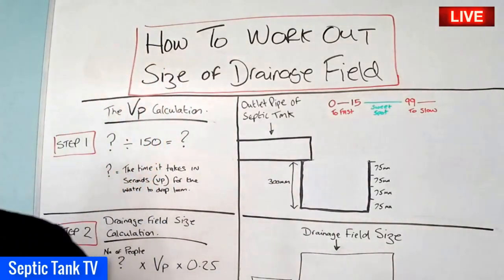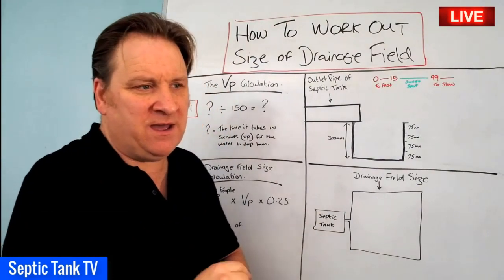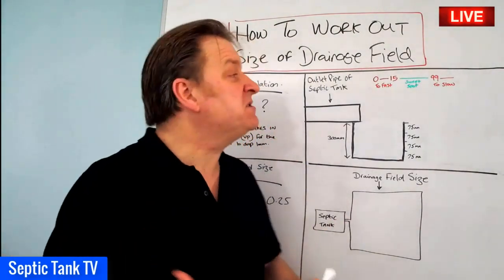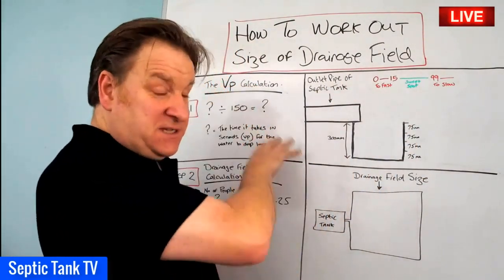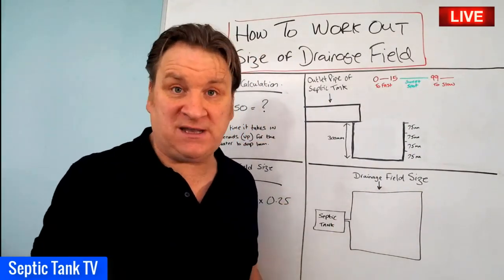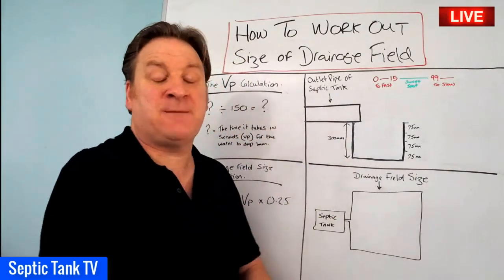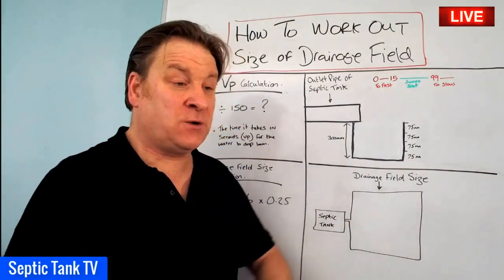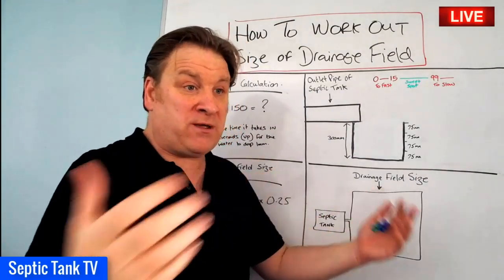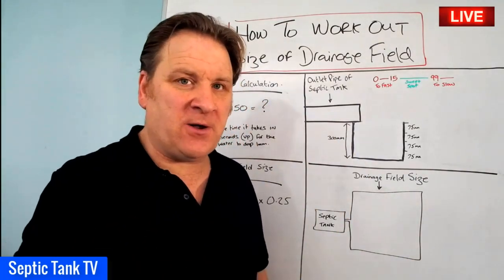Now, when I say hopefully, what I mean by that is there's certain times of the year where you don't want to carry out this test that I'm showing you. So, for example, say it's rained for the last 2 or 3 days and the ground's waterlogged and saturated, then you wouldn't do this test then, because it would give you a false reading. So you'd wait until you had 2, 3, 4 dry days, then you could carry the test out.